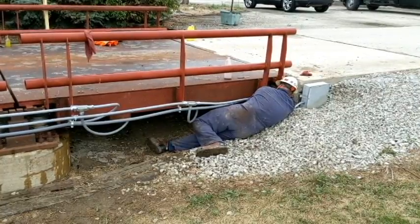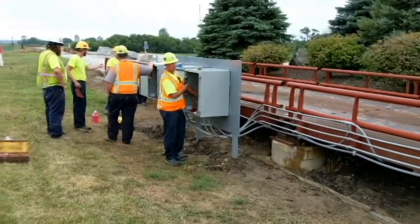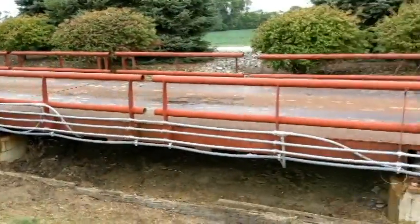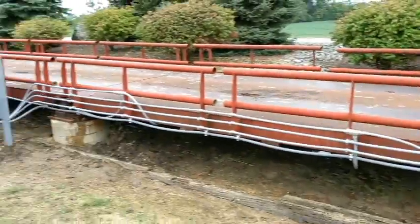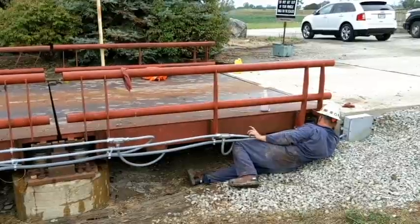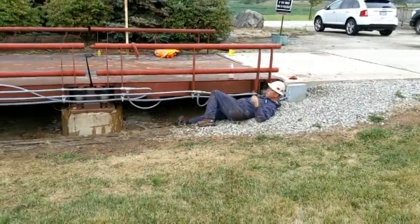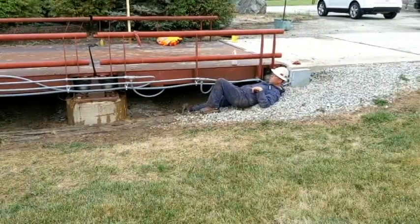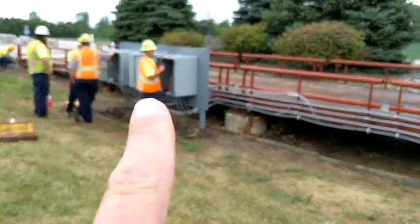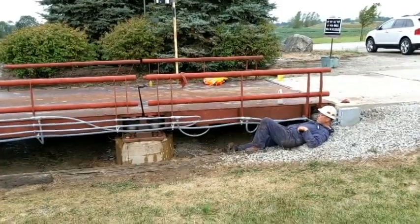Alright guys, without going into great detail — it's kind of three separate scales here. The last clip was down on the trailer axles on the other side, where we showed the close-up of bleeding the load cells. Now we're down here where Steve and Jimmy are bleeding out and setting the gap on the steer axles scale. I talked about putting fluid in the lines before connecting them to the load cell — what we do is pump fluid from where Jimmy's at through the lines before connecting them to the load cells. That flushes any debris that's in the lines out.